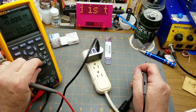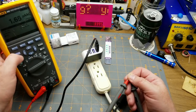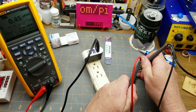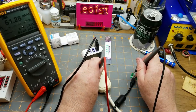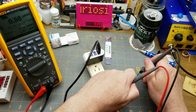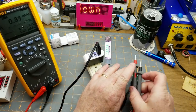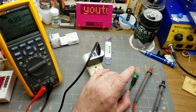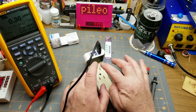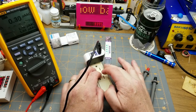Switching to microamps and using relative mode zeroed to a shorted probe: from the DC ground to the AC ground it's 61 microamps, to the hot side 69 microamps, 59 microamps, and to the other pole 58, 57, 56 microamps. So it's not nothing, but I don't think it's a showstopper. The lack of isolation gap inside and the poor transformer that Diodes Gone Wild found is probably the bigger issue.